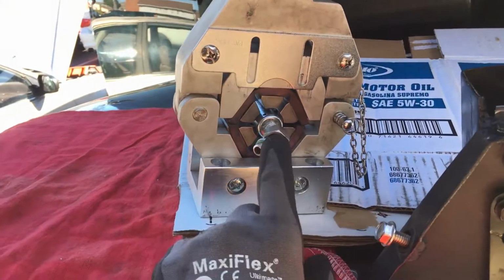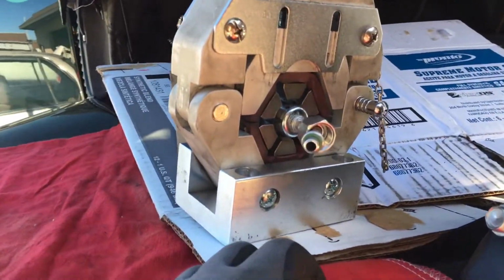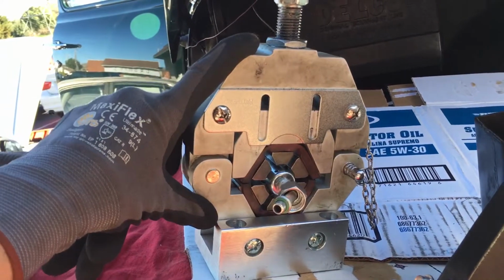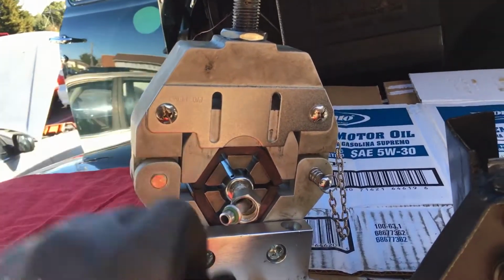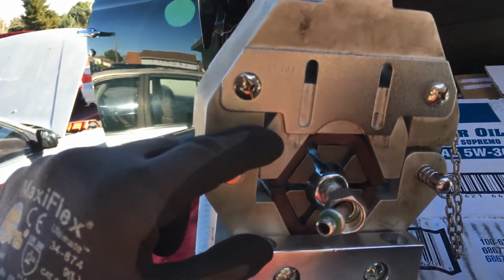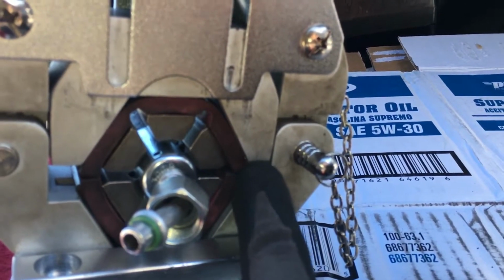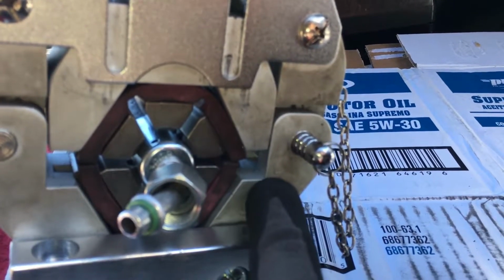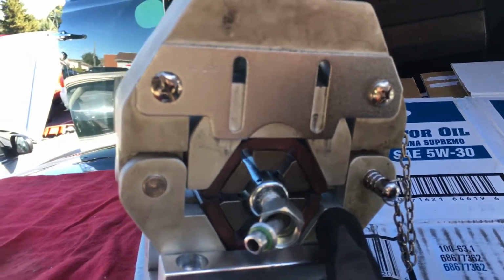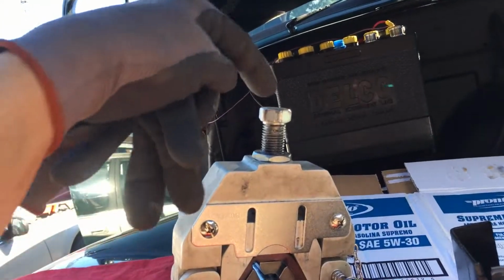So now I've set up my press so it's on the hose and the fitting and the ferrule, and let me show you something here. There are instructions by these manufacturers, and you could watch their website instructions, where as you turn this down it'll crush down, and you see this little tiny mark right there. You bring this line right here as this anvil drops down to that line right there, and you stop. You don't try to make it bottom out, and you're supposed to only use hand pressure on this using a hand bar, not power tools.